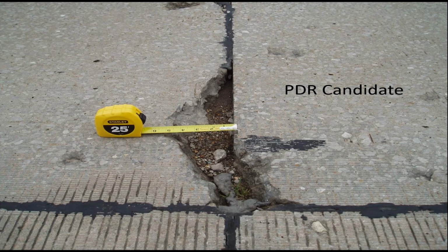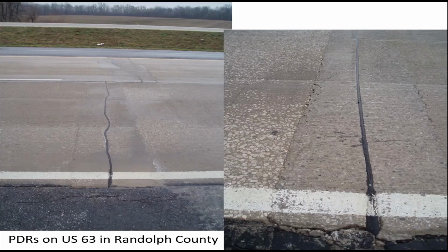I will mention, though, that there is a hesitation by a lot of people about doing partial depth repairs because they don't think the patch material will successfully stick or adhere and stay in the repair area. And pop-outs do happen occasionally when the surface prep isn't adequate and the joints or working cracks are not reestablished with form boards. So yeah, it can be done wrong. But I'm here to say that you can do a partial depth repair successfully in a concrete pavement.